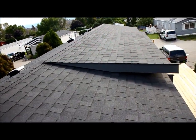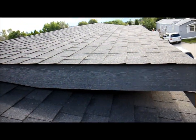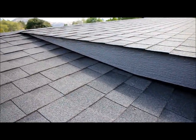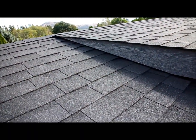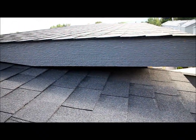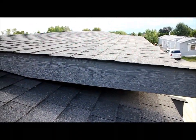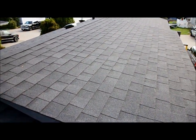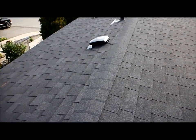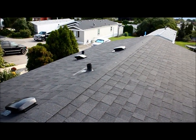This is a fiberglass laminate architectural shingle that we've used here. You can see how the fascia came together on this little raised part of the roof. Underneath that fascia we've got step flashing, and we also have our ice-and-water shield wrapped up underneath the wall down there to keep it dry. Here you can see our ridge cap shingles — that row of shingles right across the top is called a ridge cap.